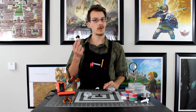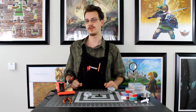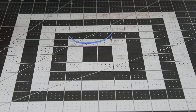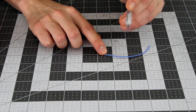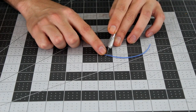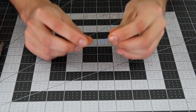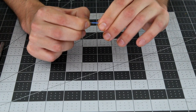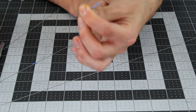To start, let's grab the battery for the prop. If you don't have access to a fancy insulation removal tool for wires, you can actually use an X-Acto knife and get just about the same results. Here's how to strip insulation: take any generic piece of wire and place it on your workbench. Grab your X-Acto knife and begin to lightly press it into the insulation. Gently roll the X-Acto knife over the insulation, being careful not to put too much force. Once you roll it over the wire a few times, take the end of the insulation and twist it until it separates, then pull the insulation off to reveal the conductors underneath.